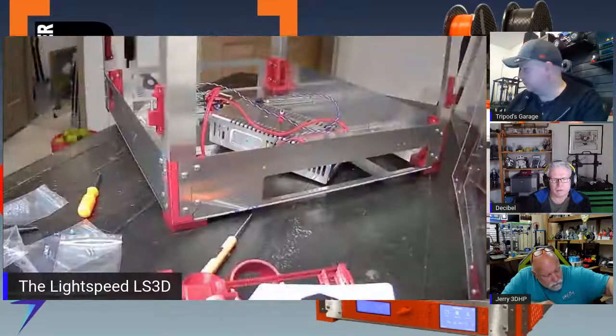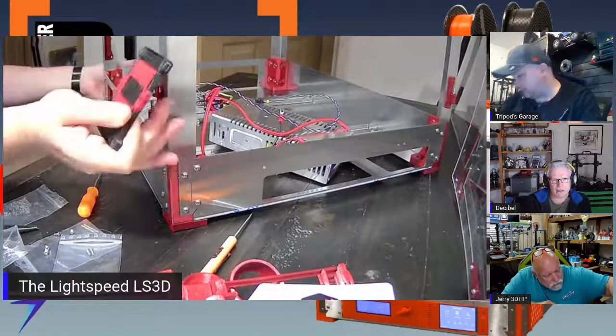So this is a side air vent for the box that does one of these deals. It's supposed to be, because the HEPA filter is going to pull out the top. This is the inlet that's on the front of the printer, and it's so you can choke it. The printer's got active cooling, so you actually put a thermistor and a unit in there, and if it gets too hot, it will turn the fan on and blow out some of the heat. It doesn't have active heating; it just has active cooling. So you've just got a PWM fan that spins up when it needs to.